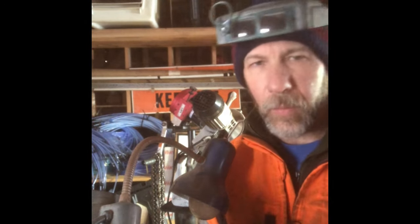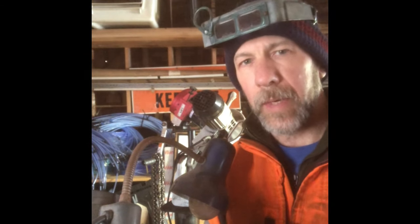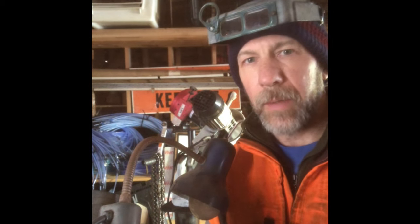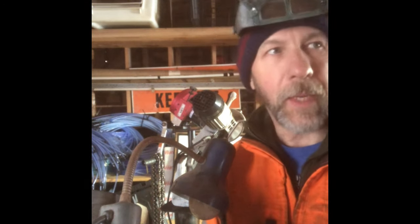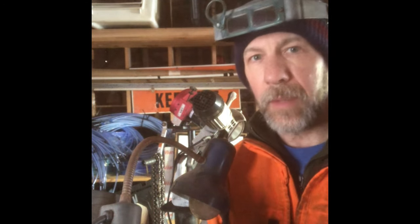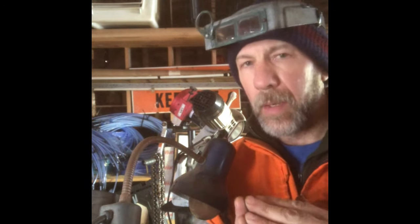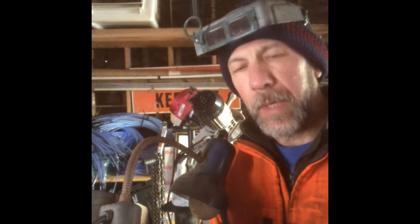A quick comment on the style of grinders: you can't take a round grinder and change it into a square grinding grinder — it doesn't work. You need a square grinding system. I'm fortunate in that I've got the old SDM4 grinder; they don't make them anymore, these things work really nice. What I'm hearing is the Symington's seem to be the go-to. The issue is that this needs to be a precise kind of grind.